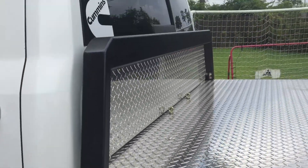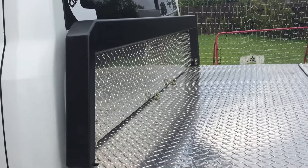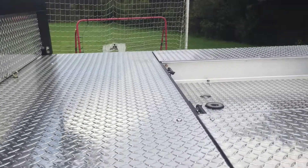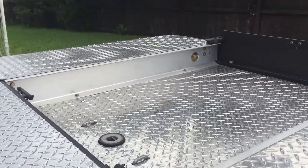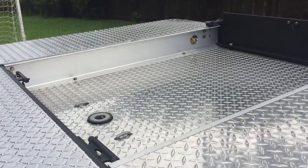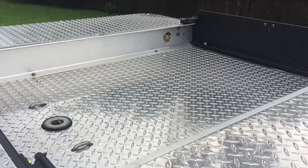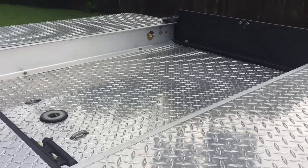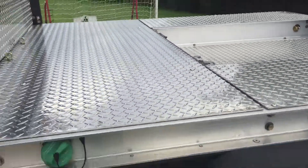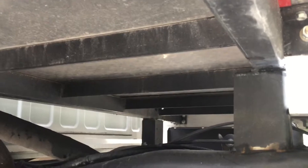It's got a box section bulkhead which also has tread plate on it. The centre section is lowered — that's to keep the gooseneck hitch at the standard elevation. That's reinforced underneath so it takes a lot of weight. At the front, this big section is reinforced with a subframe underneath — you can probably just see under there — it's a 3 inch by 2 inch box section.